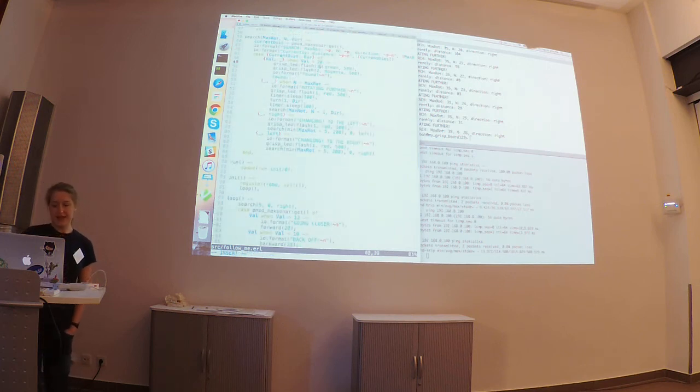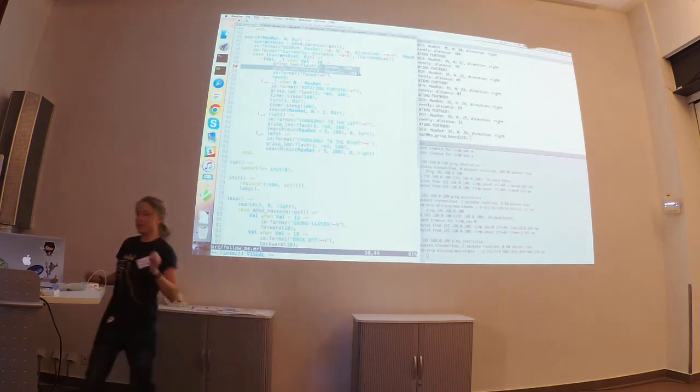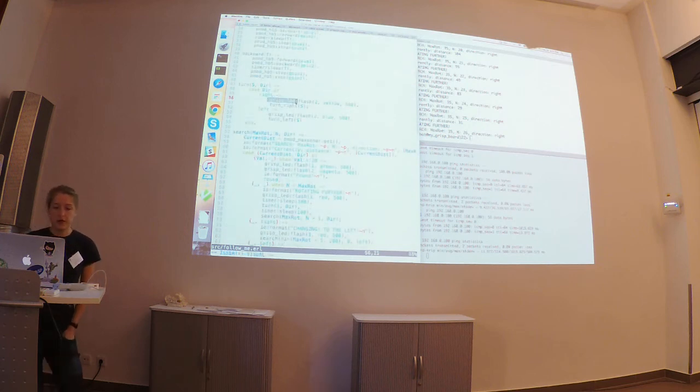So when it finds it, it switches green and magenta, two blinkers, which you can see now. And when it loops further and checks whether the object that needs to be followed is still there, but does not find it, it switches one light to red, which means, how I perceive it, I lost you. If it blinks red, it lost me. And then, to understand which direction it goes, the turning: if it turns right, it blinks the second LED yellow, but if it turns left, it blinks the second LED blue. So it's kind of a color coding debugging.